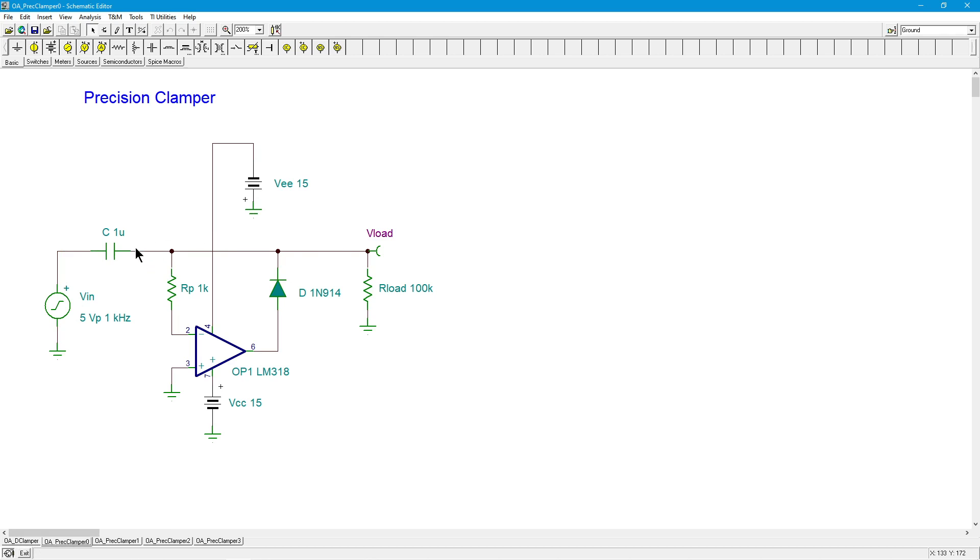Every time this signal goes back down toward its minimum value — when this hits minus 5, the output is going to be sitting at about 0. We're going to see this little toggle thing where the diode turns on and blasts out a little bit of current, refreshing the capacitor. Because this capacitor really is starting to droop — the time constant is not infinity, it will be losing signal, but it's a very, very small amount. In fact, we're going to see a little cyclic reaction here.